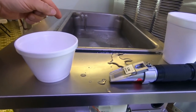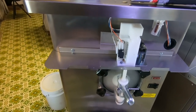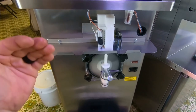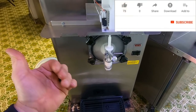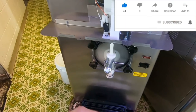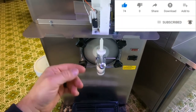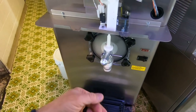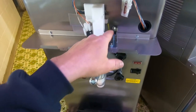There's a certain amount of sugar level in there, and that's measured in a thing called Brix — B-R-I-X. The higher the Brix level, the harder it is to freeze. The lower the Brix level, the more water it is, the easier it freezes. If that's not set correctly it could be inconsistent. So I checked it, stirred it up, it's fine — we're right in the range we need to be in, and now we're doing some adjustments here on the spring.